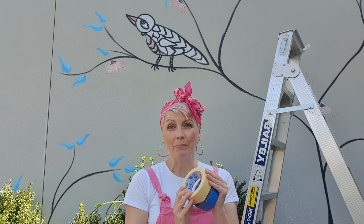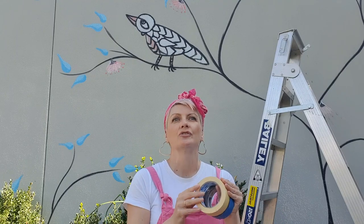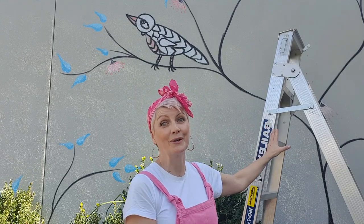Mask it up - this is really important. Normally I do this over a few sessions, allowing the prep coat to dry in between. So: prep masking tape first, then do your prep coat, then mask up again when the kids aren't around for lettering or major details. Make sure you check the weather report, because torrential rain will wash your masking tape right off the wall and you'll have to redo it - a bit heartbreaking when you've spent lots of time up ladders.